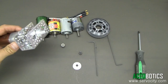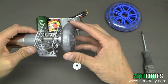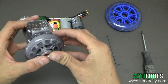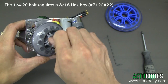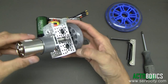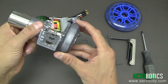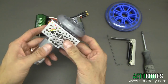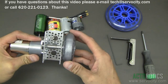Now we're going to go ahead and mount one of our wheels. We can mount a smaller diameter wheel or one of our larger blue wheels — we also offer these in various colors — but we'll go ahead and mount this smaller wheel. Press that on. This wheel mount kit also comes with all your screws and an extra hub or cupped washer. Slide that in and put in the three eighths inch long quarter-twenty socket head cap screw and tighten this down. And there you go. Now the gear motor doesn't need to take the entire vertical load of the wheel or the weight of your robot. This works really well if you're building some type of robot chassis, omnidirectional chassis, or multi-rotation chassis.